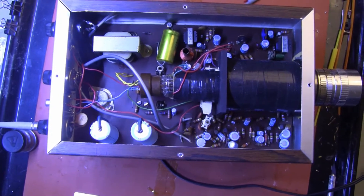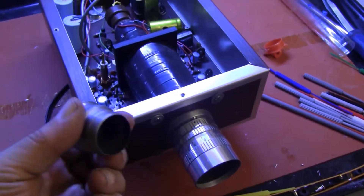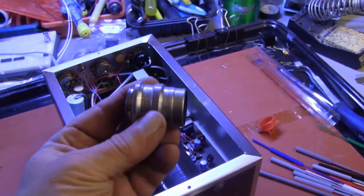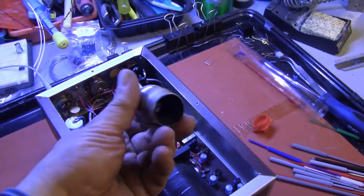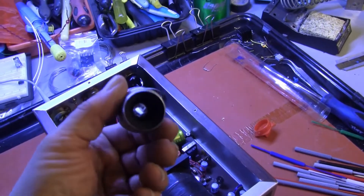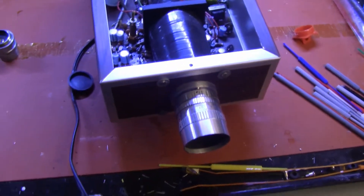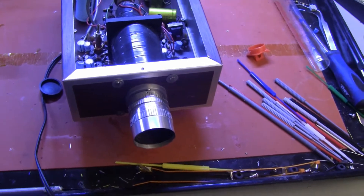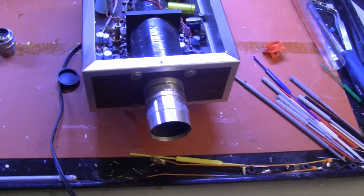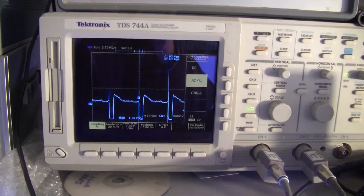This is not the original lens on the camera. The original is this one — a 1960s cinematography lens for a 16mm television camera. The f-stop on this lens is f/2.7, which is not a very strong light-gathering lens. The lens I have on here right now is an f/1.8, which is approximately able to gather twice as much light as the cine lens.